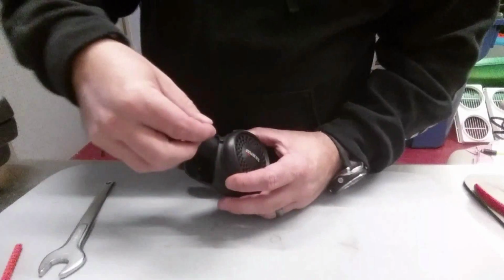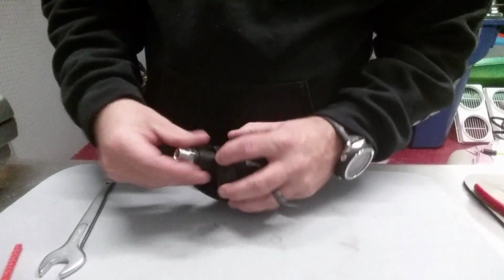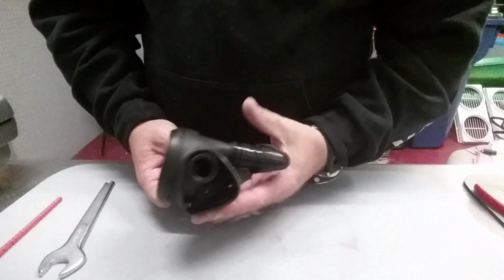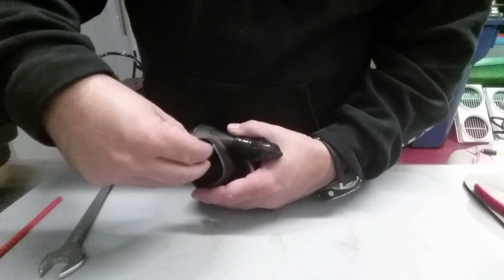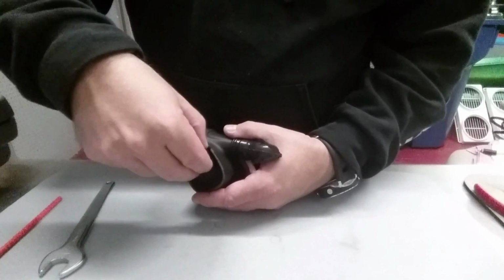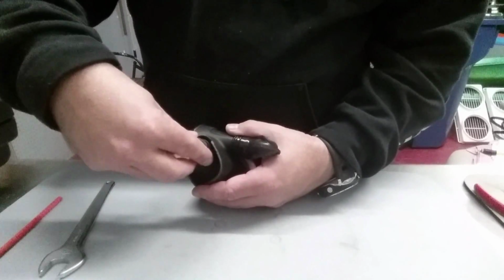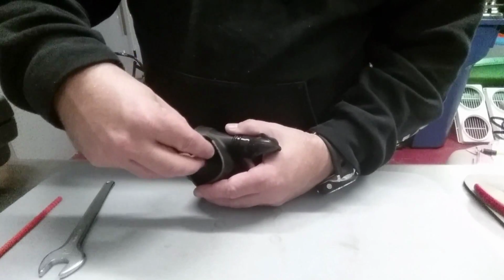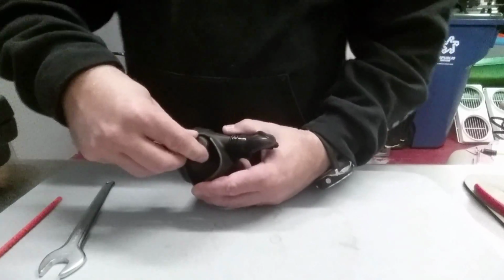And I'm going to come back in here and replace this pin. Get it pushed into position. Okay. And last, I'm going to come in here and replace this port plug. Now, I still have to tear this guy back apart and completely service it. This last part, replacing this port plug, I would actually leave the port plug out as I'm checking the cracking pressure on the second stage, just because it makes it a lot easier to get in there to adjust it.